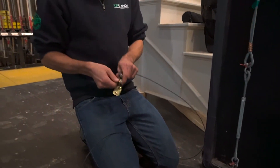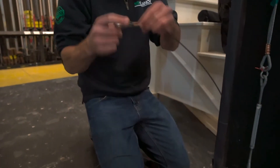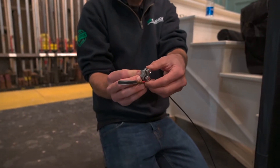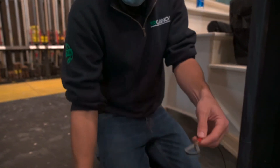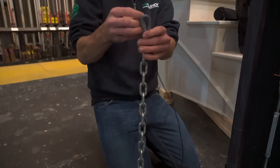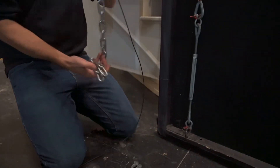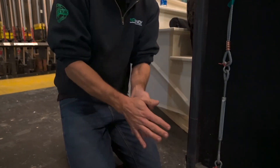Another option, if you don't have a swaging tool, is wire rope clips. Instead of a swaged sleeve, a wire rope clip goes around and pinches the cable together to form your termination — we'll talk more about exactly how to use those. Chain is also an option: we can use proof coil chain to make those connections. So instead of cable, you use chain to hang the scenery. We can also hang things from the top, especially with steel construction, though we don't want to hang from the top as much with wood construction.